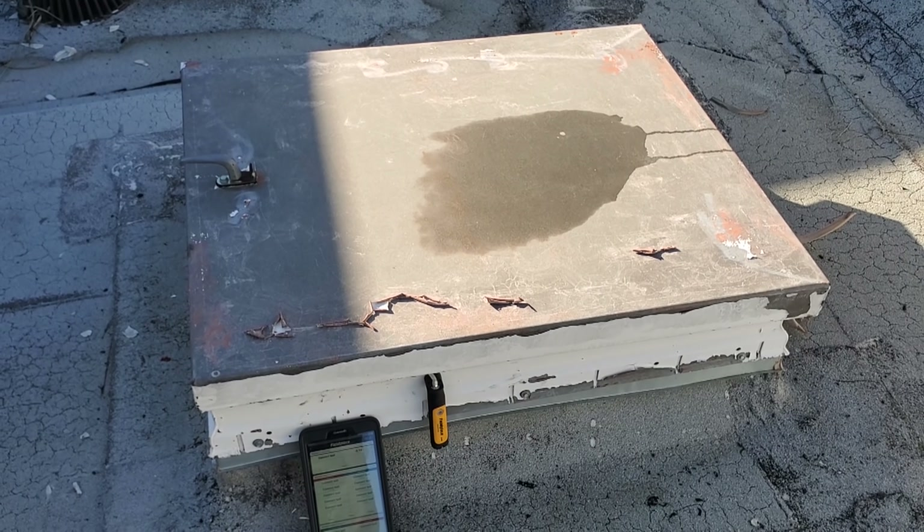I had my other guy here double check the tightness on the other belts — one was just a hair on the loose side, so we tightened that one up a little bit. This equipment is also very dirty — I'm going to let the customer know they need to get the filters changed. The filter company is putting the wrong filters in there. I also verified that the outdoor air dampers are working — since these are the makeup air units for this restaurant, I made sure the damper is actually working, and it is.